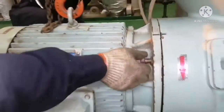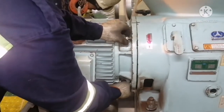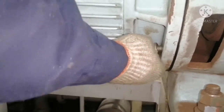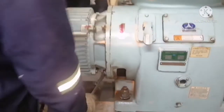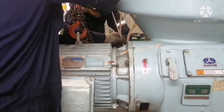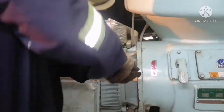The bolts are now on the proper thread. The bottom bolts can give some problem, so align them carefully so the bolts go exactly into the thread. All four bolts are in place. When tightening, tighten bolts in the opposite sequence — cross-tightening — so you get equal tightness on all four bolts. Final tightening is now complete.